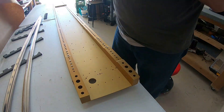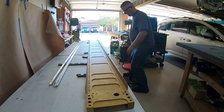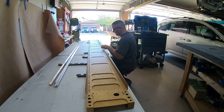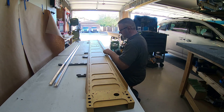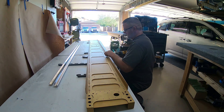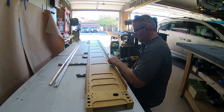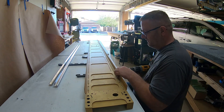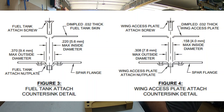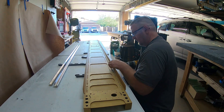There are three nut plates on the inboard side and four on the outboard side. This next part is me countersinking the bigger holes for the actual skins where the screw goes through. It feels like you're putting a huge hole in the spar — and you are. It ends up being almost three-eighths of an inch opening for the skin. It's pretty big, but if you look at the instructions it does say to do that — it gives dimensions, says don't make it bigger than this. It looks rather large, so be prepared: you'll look at it and think, oh holy crap, that's a large hole.